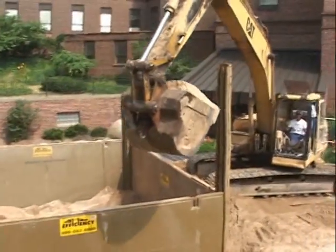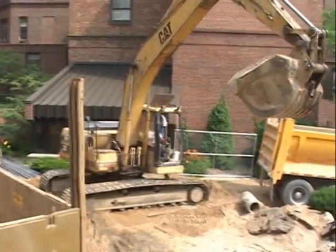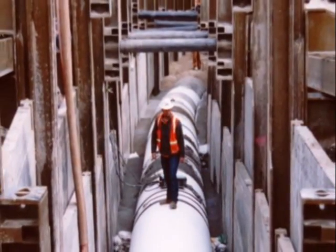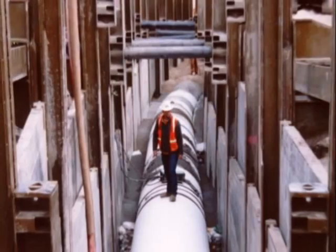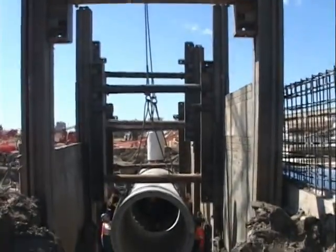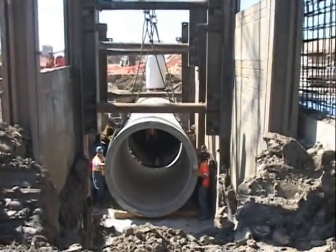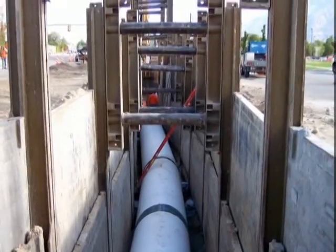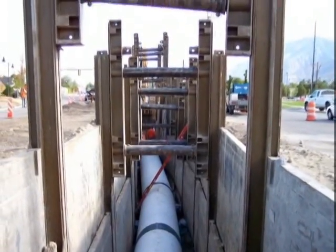A universal slide rail is not only ideal for shoring four-sided excavations, it can also be adapted for use in shoring long pipeline installation, particularly larger diameter pipe and extra-long pipe. Multi-bay configuration utilizes unique parallel beams that use standard trench box spreaders or arches rather than I-beams for cross-trench support.